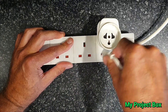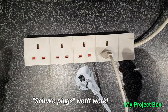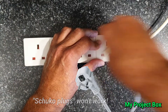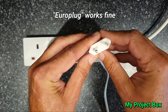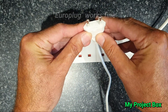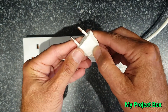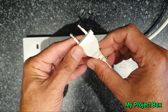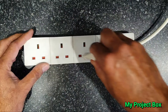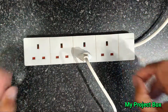These go in here fairly easily like that. The only thing I would say is you cannot do this with the Schuko style plug — the bigger one that has the earth terminals on it. You can only do it with the smaller style one that has this sort of diamond shape. These are rated for like up to 3 amps or something like that, so they're for very small loads like mobile phone chargers or toothbrush chargers. Anything with a heavy load these plugs aren't designed for, but they can actually go into a British socket — although not the correct way to do it.